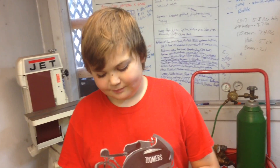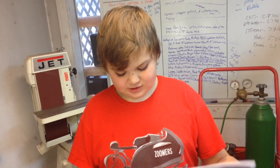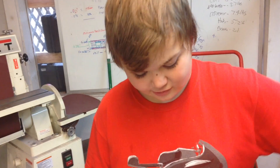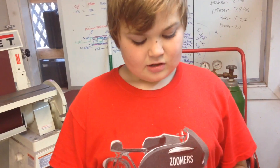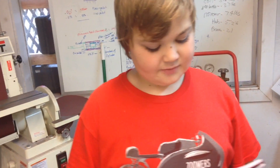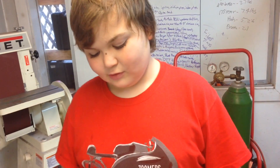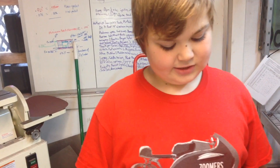We'll give you the link to where to print this off in the description. On page 518, it says: a good example for practice and to see how aluminum reacts to a welding flame — heat a piece of aluminum sheet on a welding bench, hold the torch with a neutral flame perpendicular to the sheet, and bring the tip of the inner cone almost in contact with the metal. Observe that the metal suddenly melts away, almost without any indication, and it leaves a hole in the metal — a.k.a. you blow a hole.